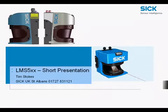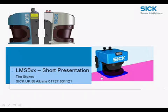This is the first of 3 presentations showing you a little bit about the LMS series scanners. In the bottom right hand side you can see the principle of operation. We send a laser beam out to an object, see how long it takes to hit and come back, hence time of flight. When we know that time we can work out the distance, and by spinning the beam around it gives us a curtain of light.